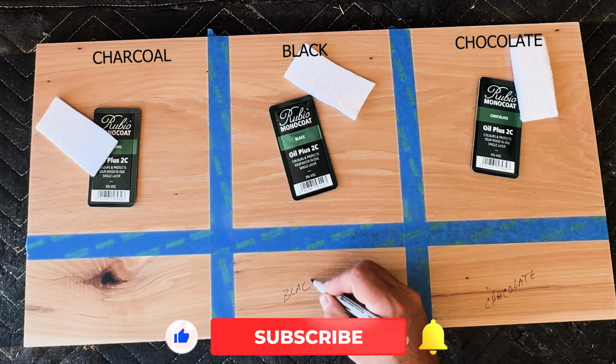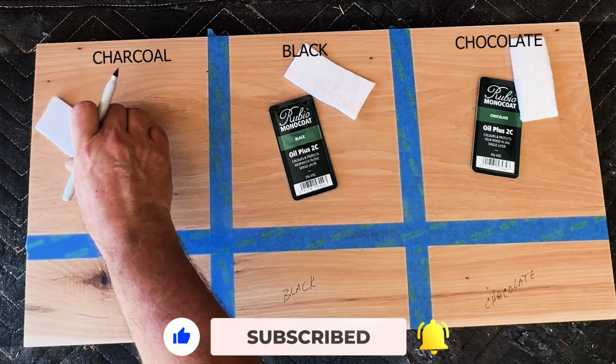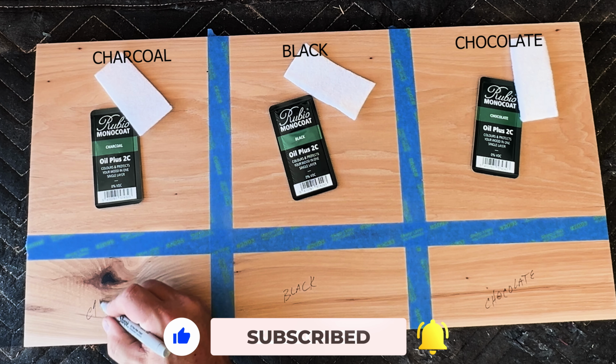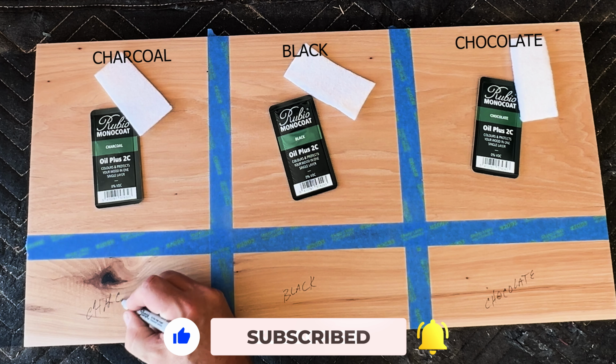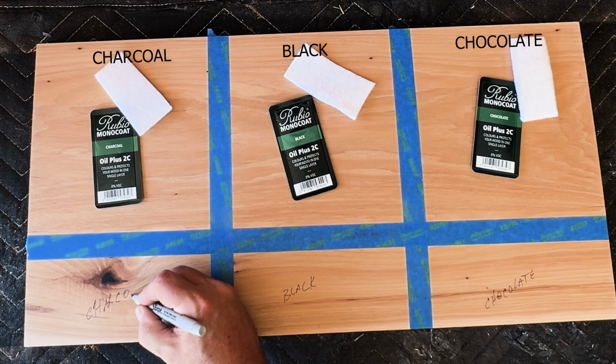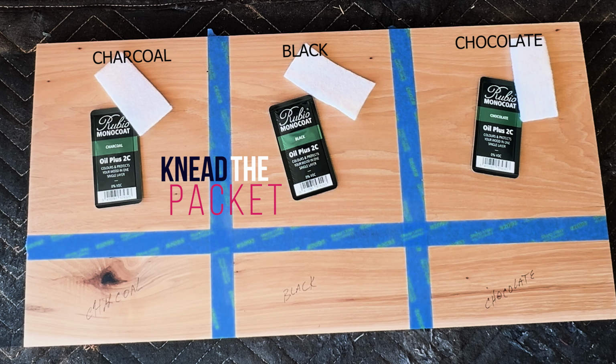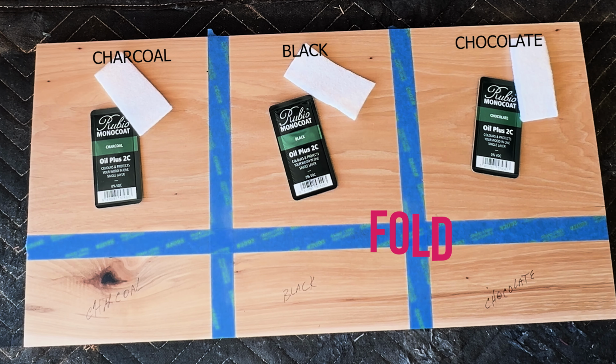I'll be using a white Scotch-Brite pad to apply the finish and a basic terry cloth towel to remove the excess. These sample pouches work really well and are simple to use. Rubio Monocoat currently offers 55 different colors. You'll want to knead the packet a few times to mix the contents. Then you can fold the packet in half and the center seam will split and the finish will come out.